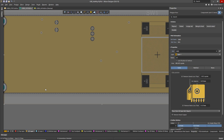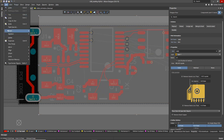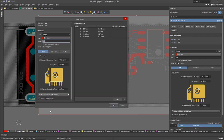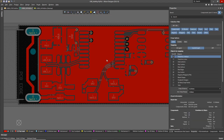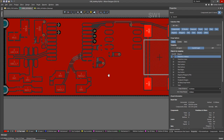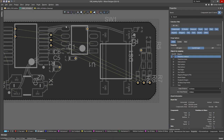Now I'm going to copy that ground polygon to the top layer using Paste Special — paste on current layer — to put it in the same position exactly. Only this one I'm going to assign to VBUS, so that's my VCC net essentially on this design. I'll re-pour this polygon. There's my VBUS, all my VBUS connections are made. I can still see that the board's not completely routed because there are some unrouted nets, so there's still a little bit of fanout and routing needed.